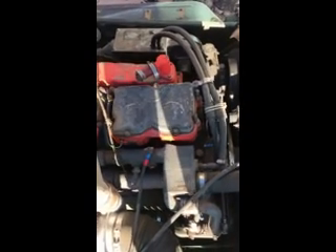I found a scrap engine that had the 25A jakes — the Jacobs brake sets sit on top of the head and actually push down on the exhaust valve, which eliminates the compression in the cylinder. That's how a Jacobs brake actually works.